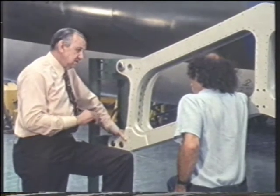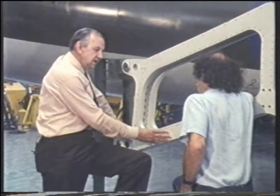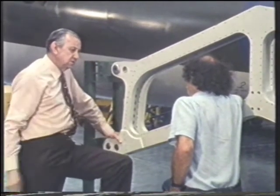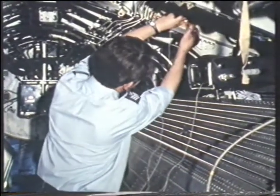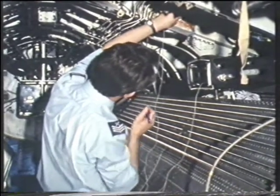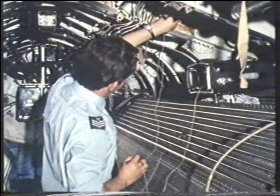As this is a very important forging, we can't be too complacent. We have to ensure that if cracking did occur, we could identify it. So what we have introduced is a defect-free inspection period: we don't inspect this forging for 10 years, and then after 10 years we inspect it at frequent intervals. Like any other major forging in the aircraft, you don't take a risk — we are monitoring this for any possible future cracking.